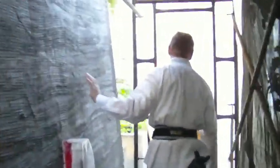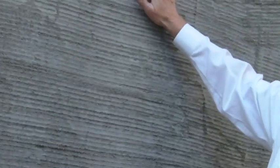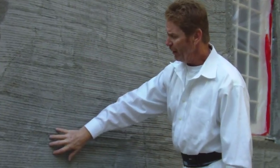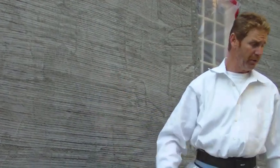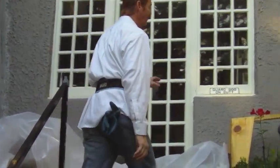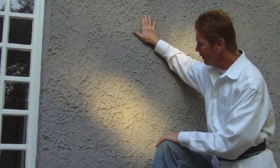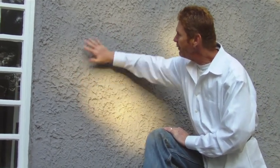Let me show you the back where you can see things a lot better. On the other side you can see the scratch coat was allowed to set too long — they put some marks in, but there's actually no mechanical bond. The scratch should be about a quarter inch deep. There's one area where it's done right; the rest has very little mechanical bond. The last guy got a sample to try to match this finish and kind of blew it. This is a tunnel dash finish — a very heavy dash. You can achieve it with a pump by pulling the orifice off the nozzle, but it's got to be soupy because it needs to run down.